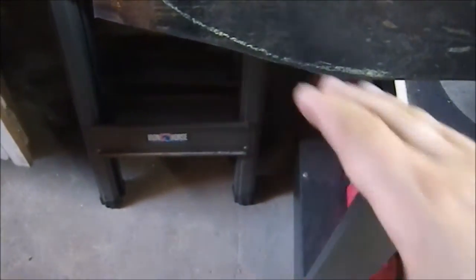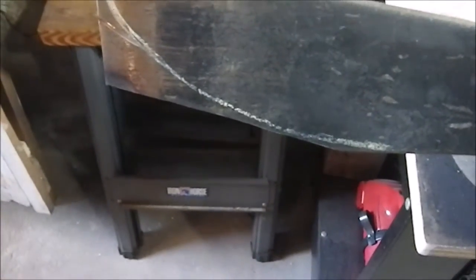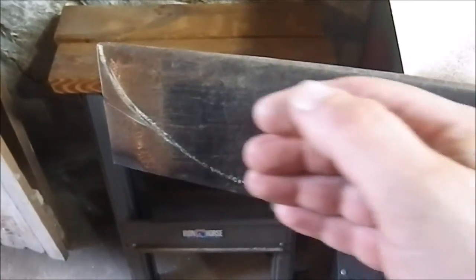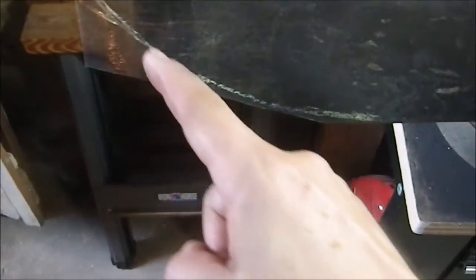So I actually ended up putting a glaze on part of the cut-off blade because I was coming here at an angle, because I couldn't come in too straight because I had to be able to follow the lines. So now I'm going to reposition this so I can get less of a vibration. I may pull this all the way in much further than it is now. Clamp on this proper, which is, wow, that's so hot. You feel the heat just radiating off of it. That's really warm. And then I'm going to come in here and do the next cut.